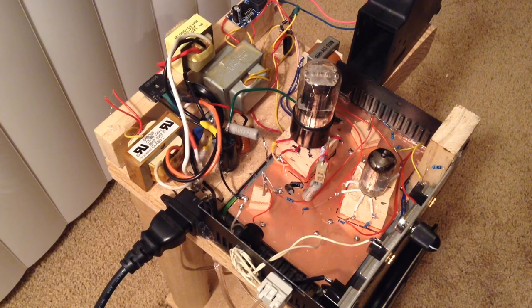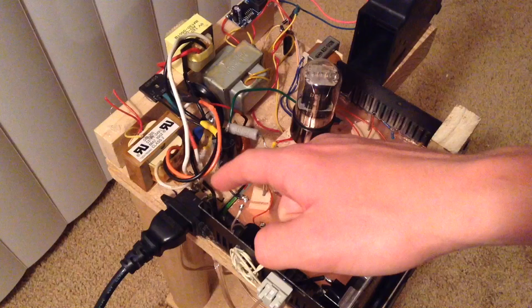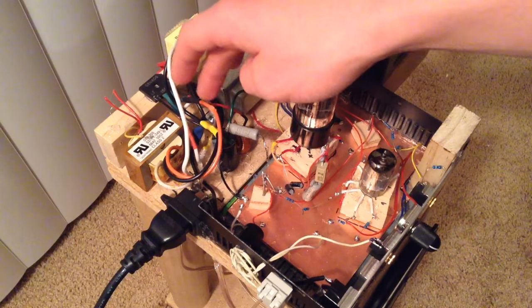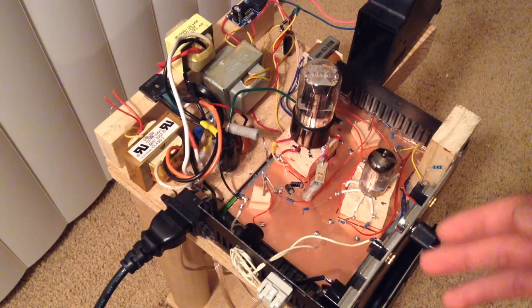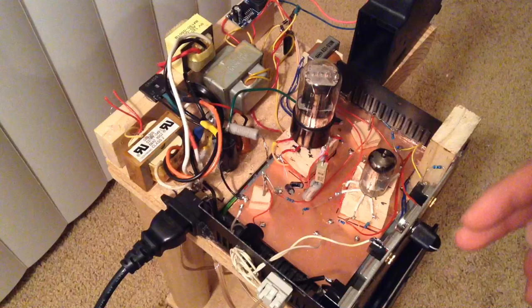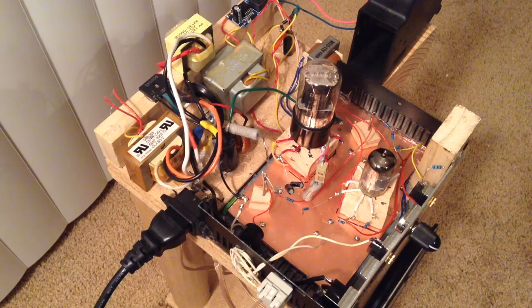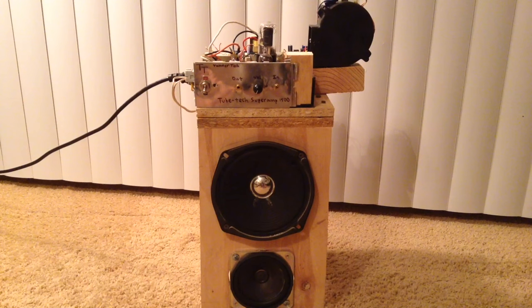Also note the danger involved in building a vacuum tube amplifier. My auto-transformer puts out 277 volts, and the bridge rectifier and capacitor step it up to 300 volts — this is very dangerous. Always make sure to have the amplifier off and discharge all your capacitors before working on it. I learned this the hard way after touching a terminal without discharging the capacitor and getting shocked. Don't build this unless you have adequate electronics experience, know what you're doing, and have common sense and safety practices. If you want to replicate this tube amplifier, please check out my Instructables page — the link will be in the description.